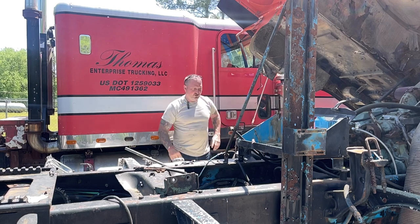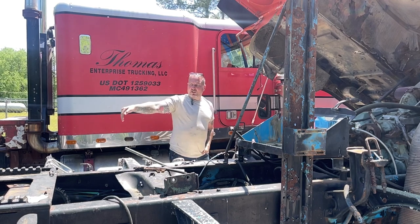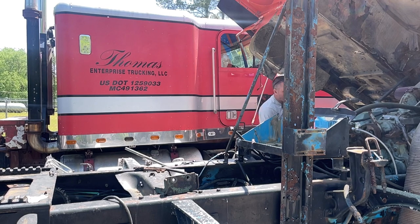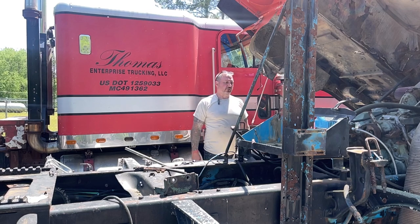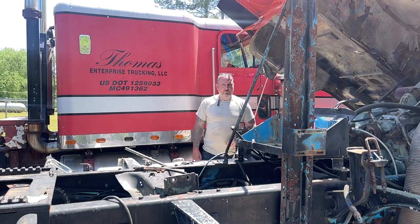One other thing I probably haven't told you yet, but I did find a radiator and a rear cutoff that I'm going to get some parts off of for Franny. But the radiator's been a big holdup on this unit because I've run this engine an awful lot with no coolant in it. And, you know, that's super hard on the sleeve O-rings. So I'm interested to get a radiator in this and get some water in it and make sure the engine's still good before we go too much further. Of course, anything that's wrong with the engine we'll fix, but it'd be super cool if there just wasn't anything wrong with it. Anyways, I'm going to get you stationed up over here somewhere so you get your eyes in there, and we'll get that mount on.